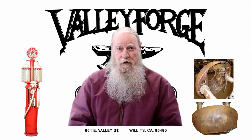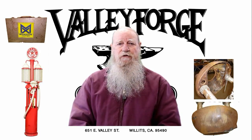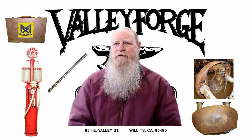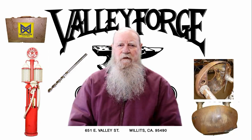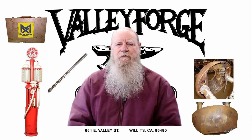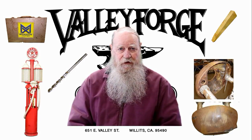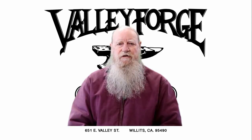In this part one of a two-part video you'll see me using a Magnaflux to determine how long the crack is. I'll also be sharpening a drill that can be used for cast iron, plastic, and brass. You'll also see how I go about preparing a crack for welding. In part two we'll start off with doing the preheat and you'll see how to use a stick to determine the temperature of the piece that you're heating up. So let's get started.